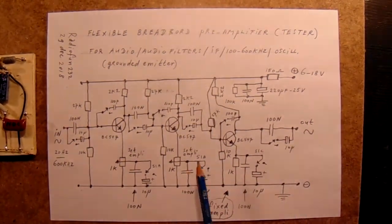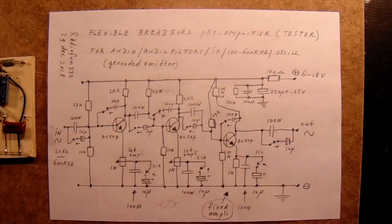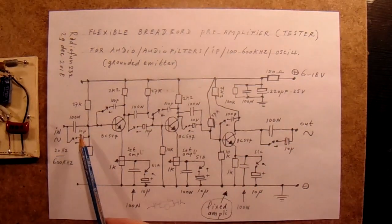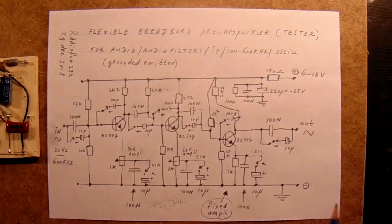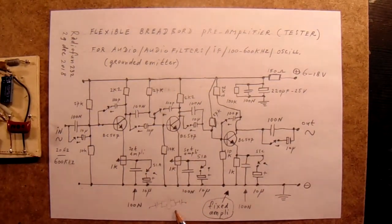Also interesting perhaps, you can make such a circuit frequency dependent by making a frequency dependent circuit normally consisting of a capacitor bridged with a resistor, and here a cap too, and here also a cap, and connected from the output here with a wire to the input. And you will see when the circuit doesn't start to oscillate, that depends also on the frequency and on the phase, but try it. It's the best thing to do to learn something from it. You will see that the amplifier gets a kind of bandwidth due to this part of the circuit. This is a frequency dependent unit.